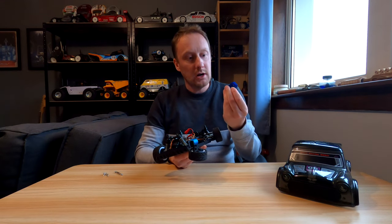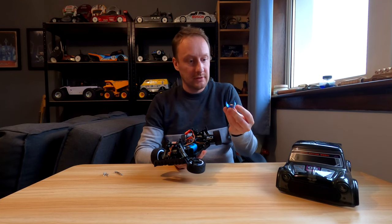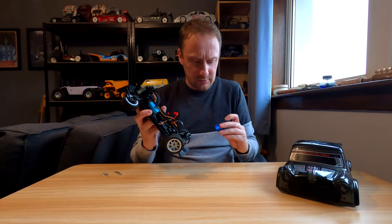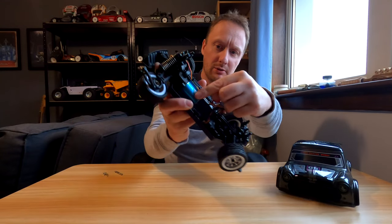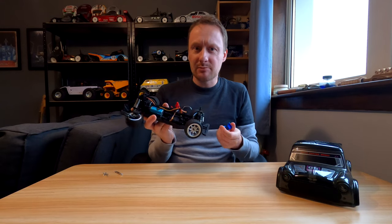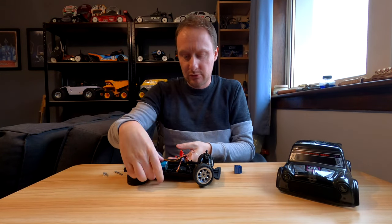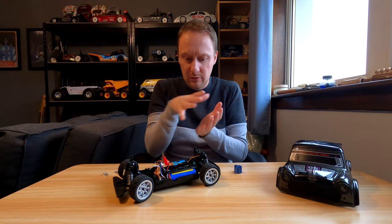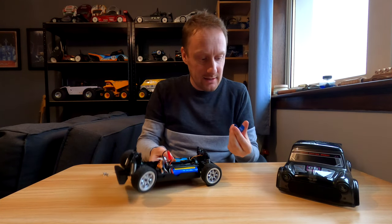You saw how bent out of shape it became? I bent it back and it sort of fits over it, but weird. And what's also a bit rubbish is you see it's been stuck on with some sort of adhesive. Kind of negates the point of a heatsink. A heatsink's supposed to have as much contact with the surface of the motor as possible. It's supposed to be contact all the way around it with no gaps so that it can transfer heat through it. It's a heat sink.